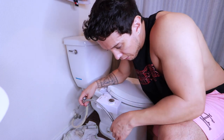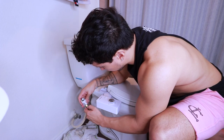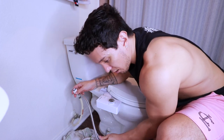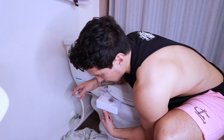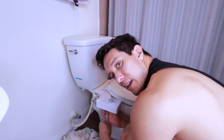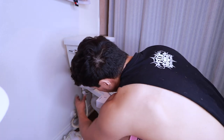Side connection — use a wrench to tighten if necessary, but don't over-tighten. How do I know if I'm over-tightening? Okay, that seems nice and tight. Hand-tighten the other end of the flexible steel hose to the connection; use a wrench to tighten if necessary. Attaching it to the bidet — okay, I think that's pretty good. Now attach it to the toilet.